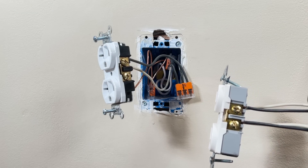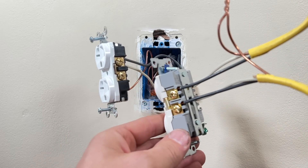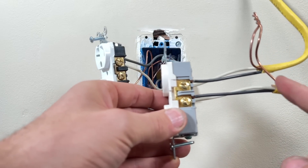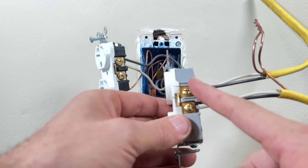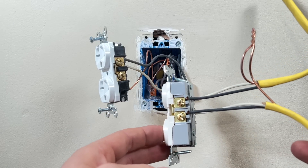Secondly, associated with the National Electrical Code: if we use the outlet itself — using this device to take power in and then provide power out — that is actually against code. You should not be depending on a device to provide power to a receptacle downstream.